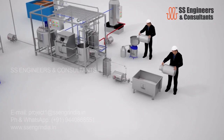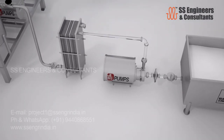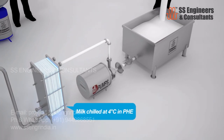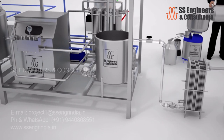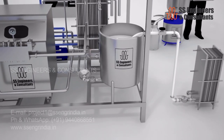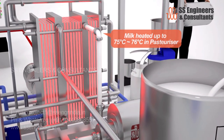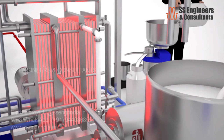In the milk processing module, milk is poured into the weigh scale tank. After weighing, the milk enters the dump tank located below the weigh tank, and is then sent to the raw milk chiller through an SS centrifugal pump. The raw milk chiller cools milk from 35 degrees Celsius to four degrees Celsius in one hour, using chilled water circulated through SS plates. The milk is stored at four degrees until further processed. The chilled milk is then transferred to the HTST pasteurizer, where it is heated in two stages in the plate pack pasteurizer from four degrees up to 75 degrees Celsius.